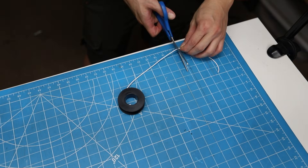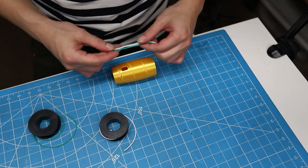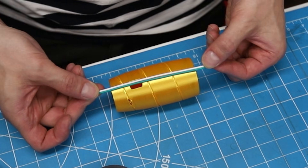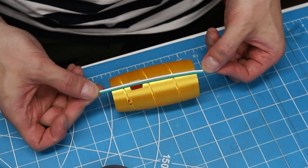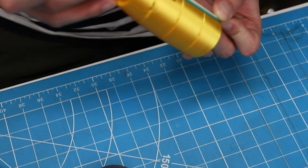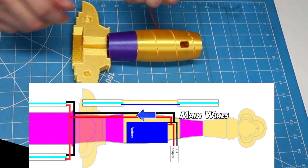We need to connect our LEDs, so let's start by cutting two 5-inch wires. These will be the connection wires for the short LED pair. Color doesn't matter. The important part is to pay attention to your positive and ground wire. Make sure these strips are longer than the handle grip. Next, we'll need to cut the main wires — these should be at least 10 inches.